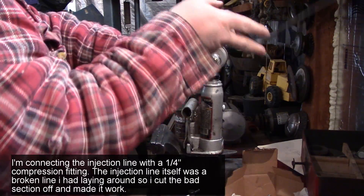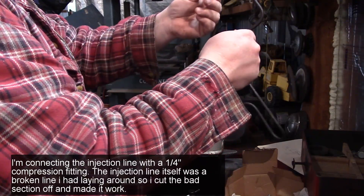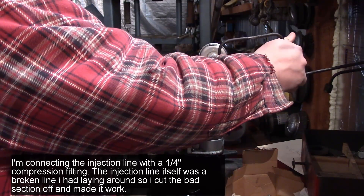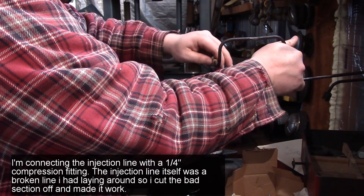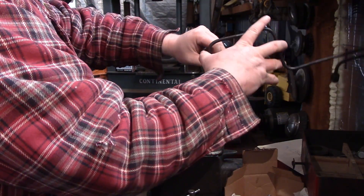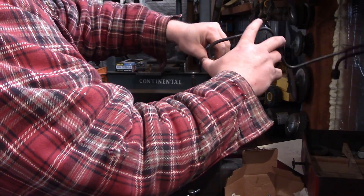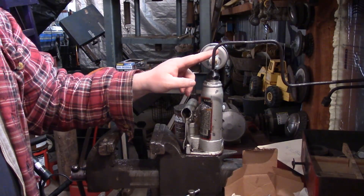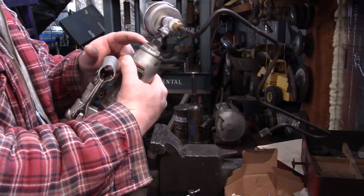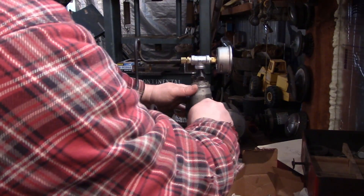Now I've got a slow ejection line. I'll decide which way I'd like to place it — I think we'll place it down, that should allow for a straight down pattern with my ejector. I'll probably set it in some sort of jar — I've got some old mason jars, so I'll use those. I'm going to finger tighten that for now because what I want to do is fill this up with diesel fuel and purge it. That's a lot of space I'm going to have to fill up where that ram used to be, so I can imagine I'll be filling it up quite a few times.